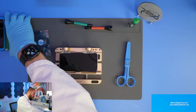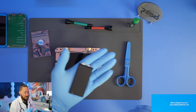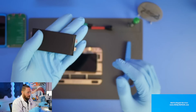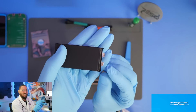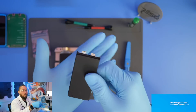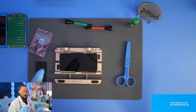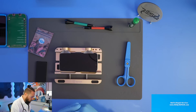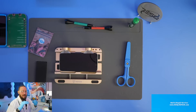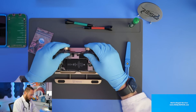JC sent these things today for review and I didn't have a copy battery here. The only thing I found for the iPhone 12 Mini was this. Normally these strips are a little bit longer because we have to form the cable, but just for showing you how it works, we can do it. What we have to do to get a working phone with no battery error message and with battery capacity is swap the BMS — the battery management system — which sits on the bottom of the battery in the flex cable.